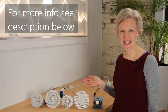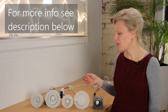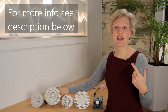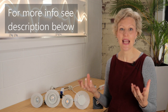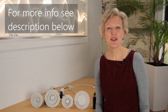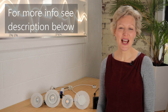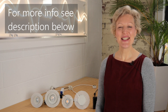So I've reviewed the five trimless downlights. All are well built but have different pros and cons, making them suitable for different situations. My personal favourite is the one from Astro Lighting: it has integral fire rating, it has a GU10 light bulb so you can easily upgrade if you want to change colour temperature or beam angle as LED bulbs improve, and it's a reasonable price. I hope you found this helpful — please comment below with any questions or your experiences with trimless downlights, subscribe to my channel, and see you next time.